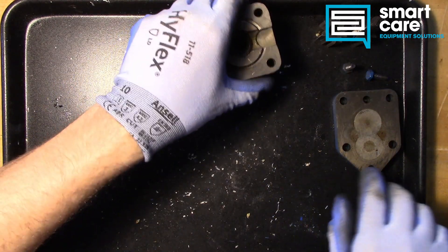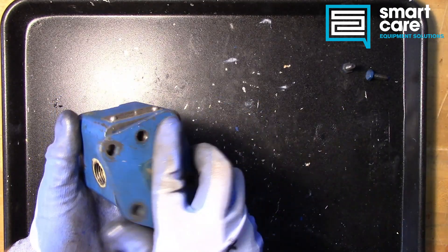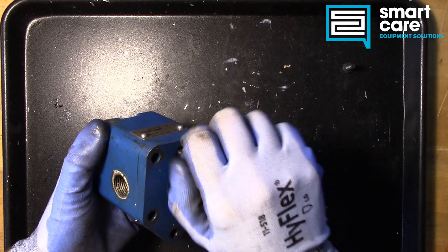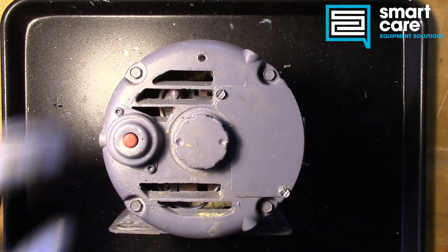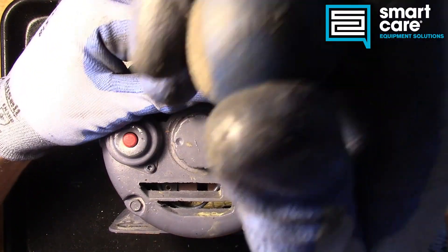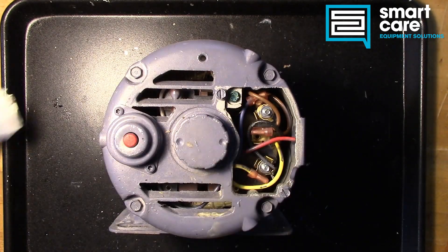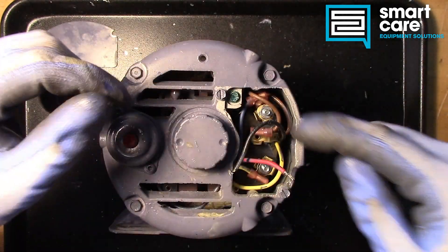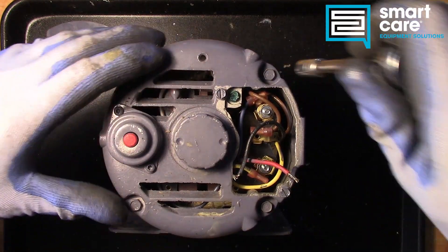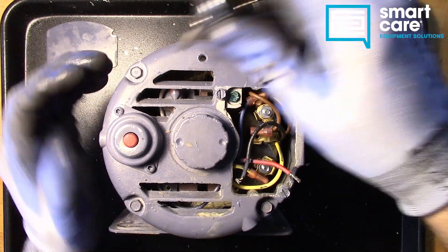Let's set this off to the side, and I think we actually will tear down the motor. So our first step is to get the cover plate open. You can see there's no instructions in here, but there are a number of connections and terminals. So if this had for whatever reason all been disconnected, we would have to come in here and just double check all the wiring. What we want to do next is pull these torx screws here and take a look inside the thermal overload.